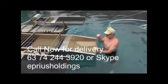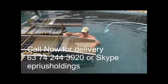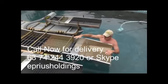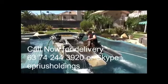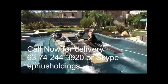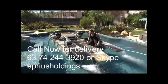Now to do a cleanup, I'm going to take this riffle board here and remove it. I'm going to flip it upside down and wash it. I've now got all my riffles removed, and I have just one engine running, with all the material washing over here. I might even have to rake some of the rocks out. And if you do have any big gold, you want to check along this line here, because you could have some gold nuggets piled up on the screen. You don't have enough water velocity and force to wash the gold over the edge.